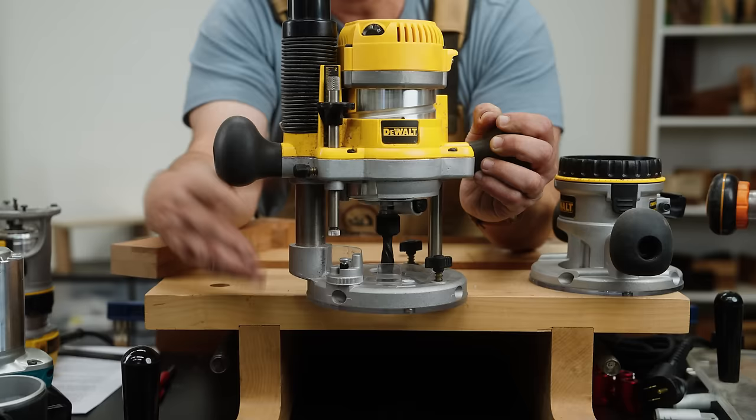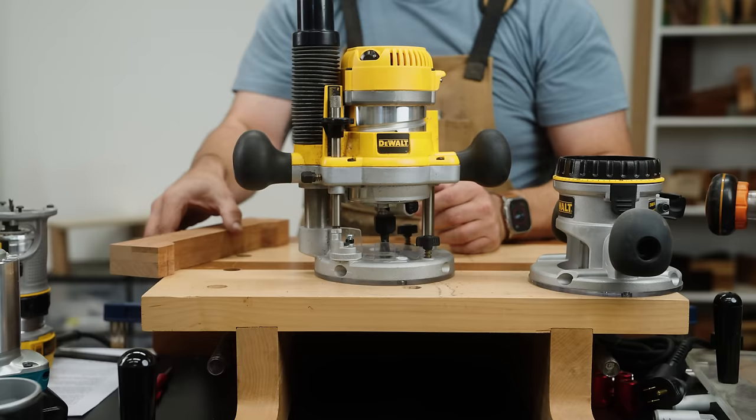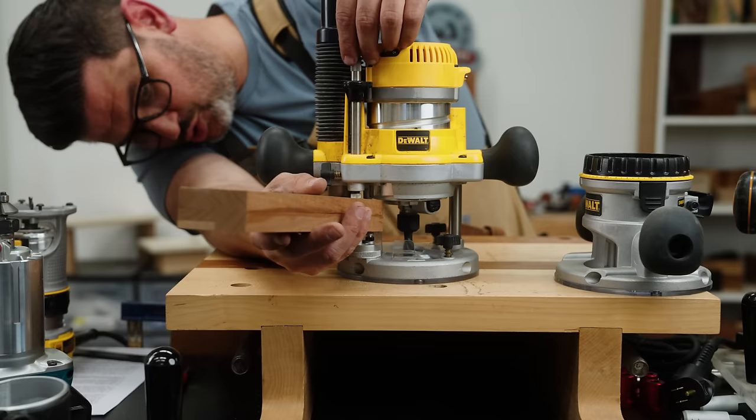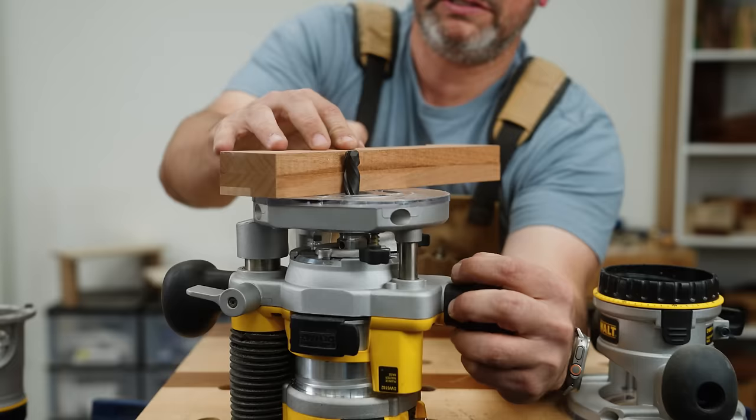Here's another great way to use this. We're at zero. Now we want to cut down to do some joinery — let's say we have a tenon. We could take any piece of material, lift this up here, put this between my depth stop and that top stop. And I now know that is going to be exactly the depth of my material. You can see — look at that — that's the exact height of my material there.